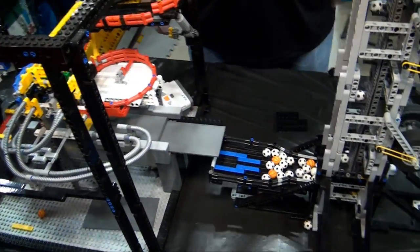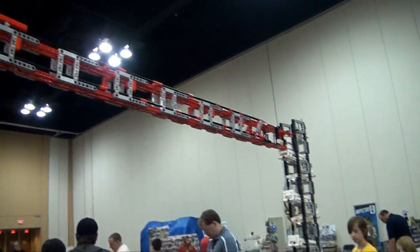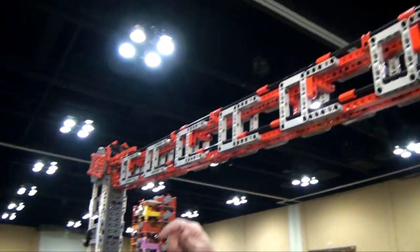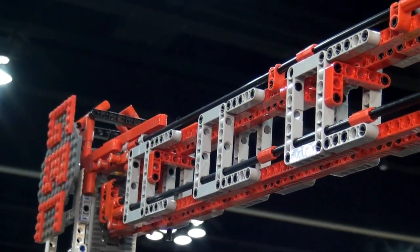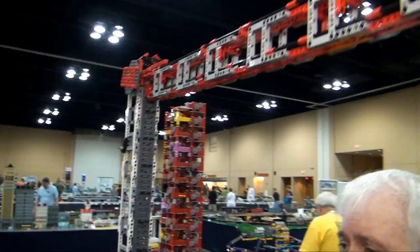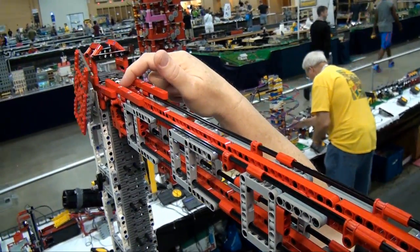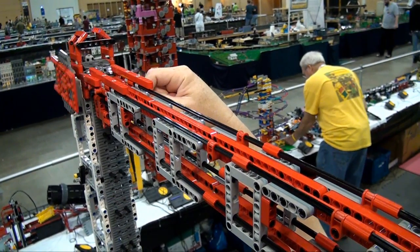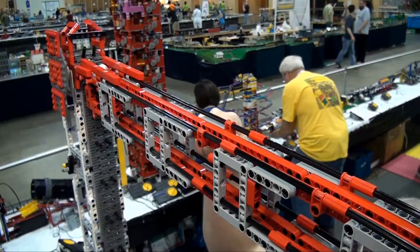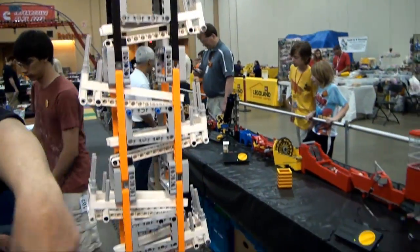From there once they come out they go into a doorway module — it goes up a big conveyor and across a ramp to the other side, allowing us to walk underneath without climbing under tables. One interesting thing is the continuous problem with tops of conveyors: a pair of pins brings the ball up and you have to get the ball out. This one has a spring-loaded pin so if the ball fails to get on the top ramp, it goes down a second ramp instead — a nice safety save.